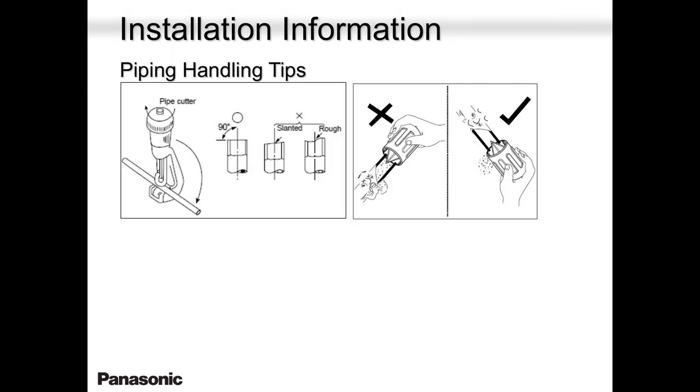Copper tube. When you're dealing with copper tubes, mostly on commercial jobs, they're using crimping tools. Residential, not really. You don't need a crimping tool and to invest lots of money. Just become a pro in flaring. Really, flaring is your worst enemy, I know that. But if you use a little bit of compressor oil, your reamer, you know, the deburring tools and all that stuff, everything will fall in place. No leaks. Everything will be good.